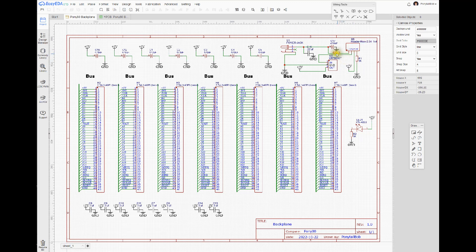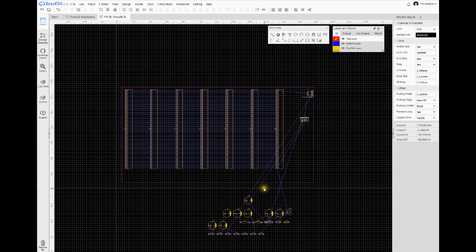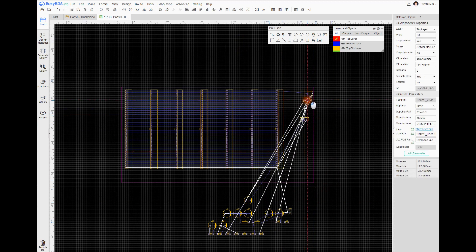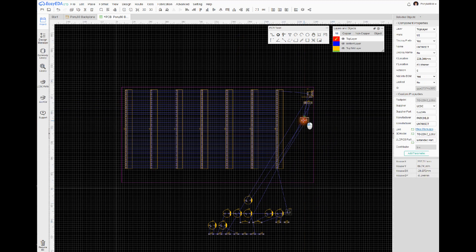Right now we're just going to switch all those amps through a switch on pins 1 and 2. On pins 3 and 4 we have a way to hook up an LED through a 1K resistor from 5 volts to ground, so we get a power indicator. That's what that header is for.